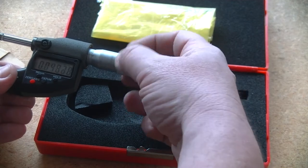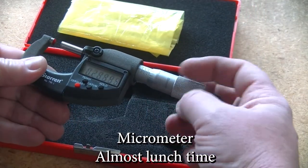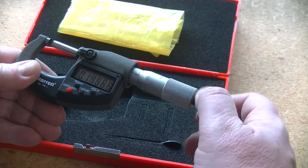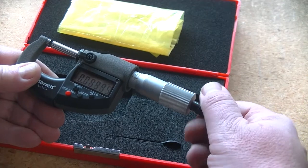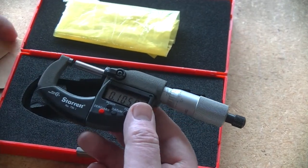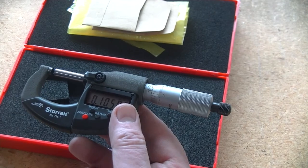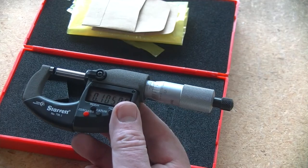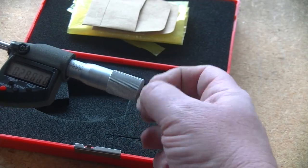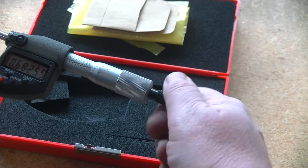So when we rotate the button it asks us to zero. The tool must be in the absolute mode for the datum button to function. Typically the datum will be set to the shortest measurement position - for example, the anvils closed for the 0 to 1 inch and 25 millimeter versions. So we hit datum zero - there we go. We can open up our fancy schmancy micrometer. One revolution past maximum distance is as far as you get to wind this bad boy out.